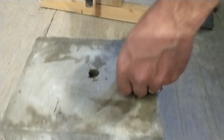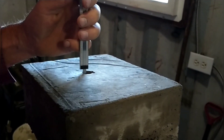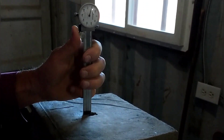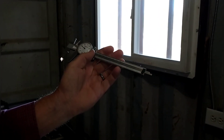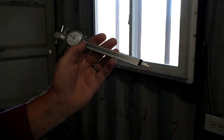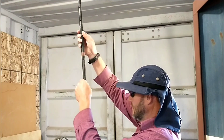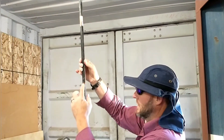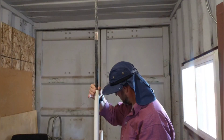Here you can see our testing on the standard mix batch. We did the drop test on the front and back. On the top we had a depth of 0.63 inches or 16 millimeters, and on the back we had a depth of 0.68 inches or 17.3 millimeters. It actually went in just a little bit deeper on the back than on the front, but not significantly, which was a little counterintuitive.